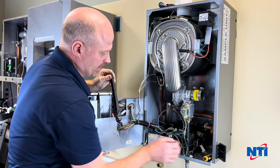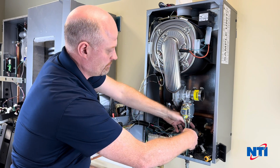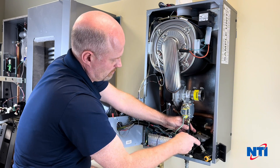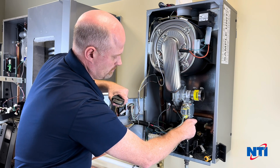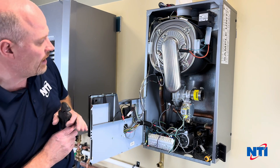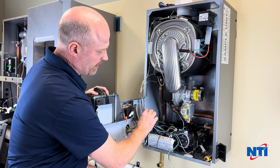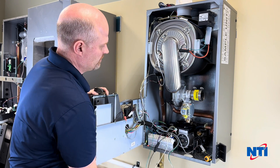Once your gas line is isolated and disconnected below, you'll want to remove the gas line from the valve here. Now that we've removed those parts, unplug the gas valve and the two wire connectors on the combustion fan motor. Set them to one side.